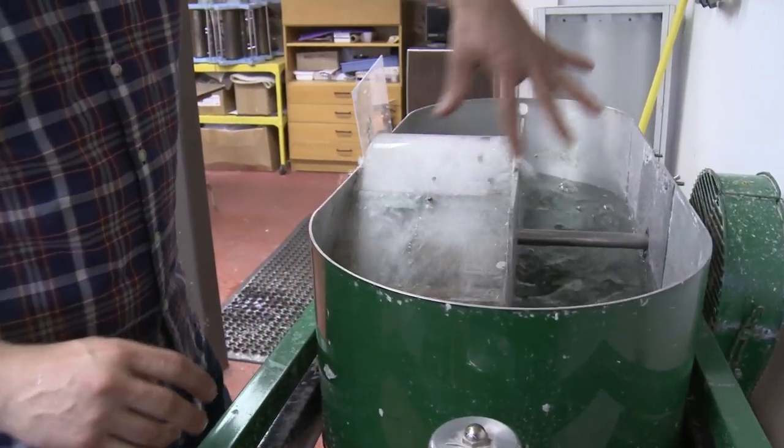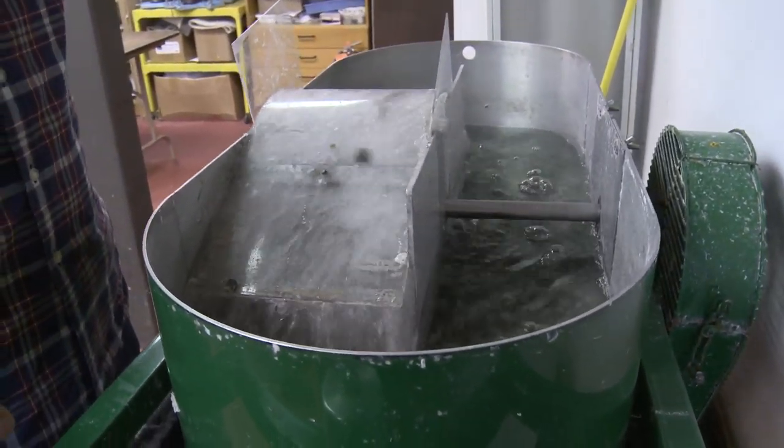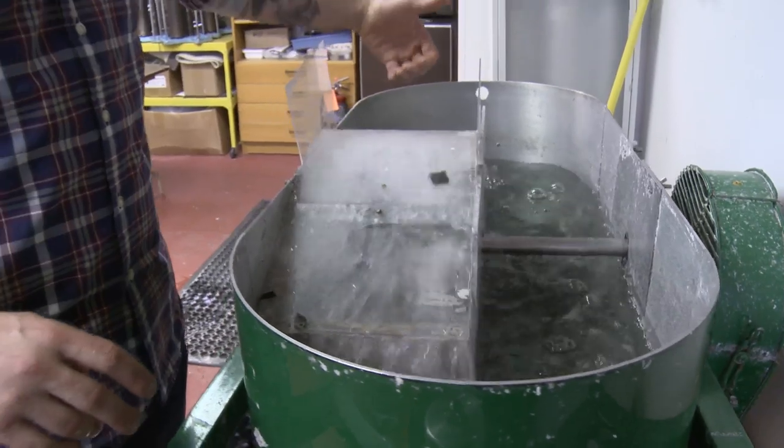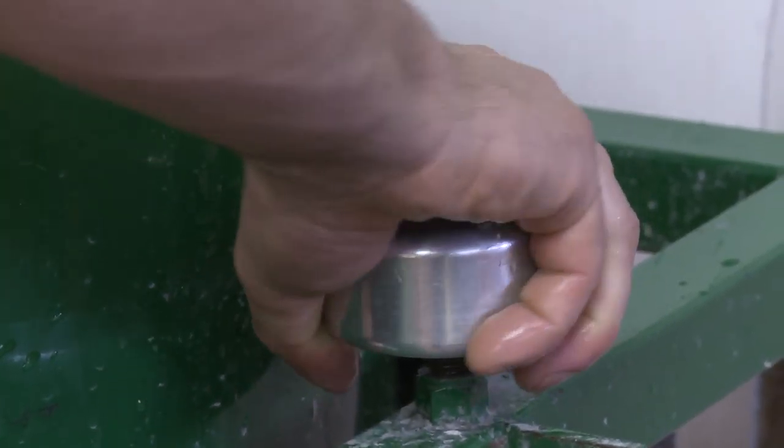What's happening now is the fibers in this uniform are being moved around the trough, and there's a wheel that macerates all the fibers against the bed plate — basically breaking apart all the fibers of the uniform. It takes a while; this is going to take about three hours to break down. If we had a really good beater, it wouldn't take that long.